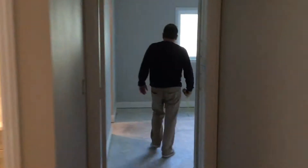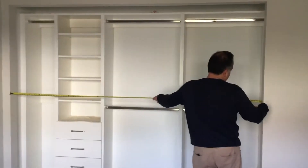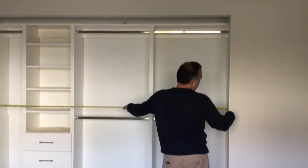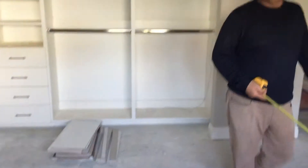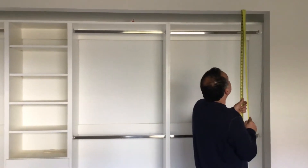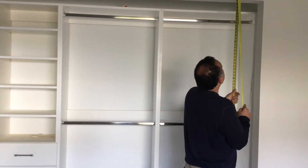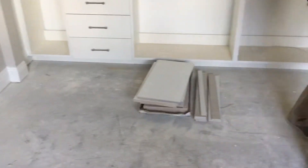There are some moldings on the floor but this needs to be done. In the master bedroom, you need to drill the holes for the faucets. This is going to be a three-door track — it's 99 and a half inches. I'm not sure if they even make a 99 and a half inch track, but assuming it's a triple door track, all three doors ordered need to go on here. Find out what color she wants it, because it needs to match the handles she's buying. Double check before ordering this track. Right now this is 85 and three eighths from cement, and Mark would have to do pad outs before carpet can go in.